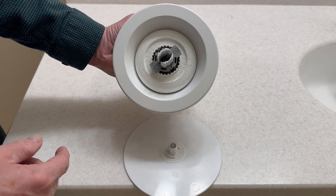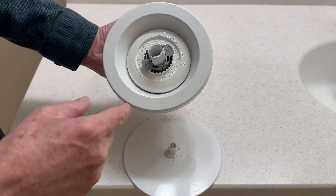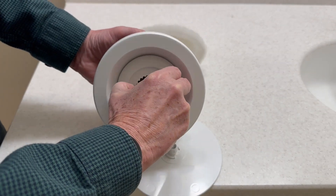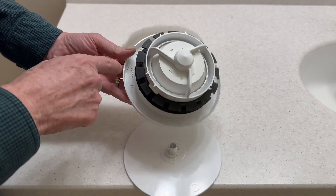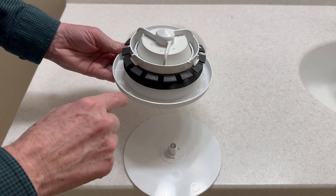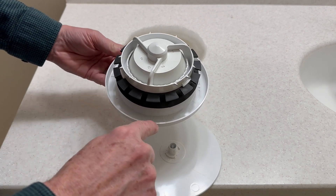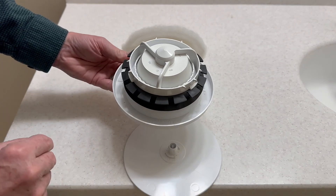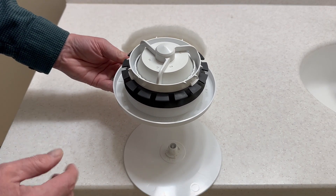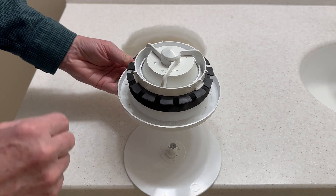There's a tiny little gap — a little bit of air could go through, but this is mostly closed, and then you could lock that if you want it like that. The person commissioning the system is going to set these numbers. On the back side of this, they're going to write the room and the type of valve, and they're going to put the stage number — one, two, or three — and then the setting zero through 25. That's where they should stay after commissioning. The person commissioning it determines what the numbers need to be to get the right amount of airflow.